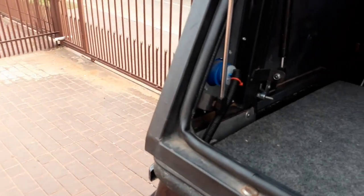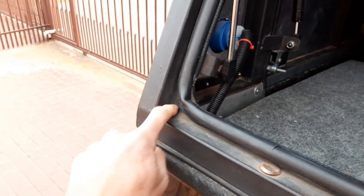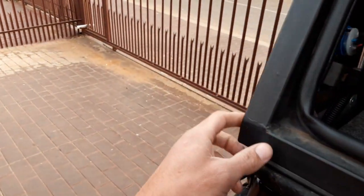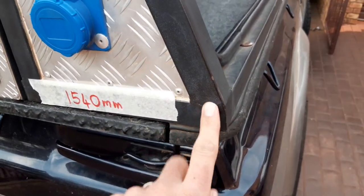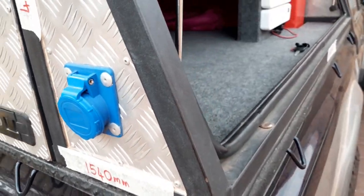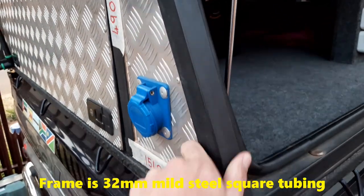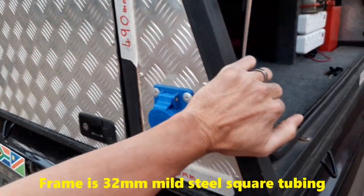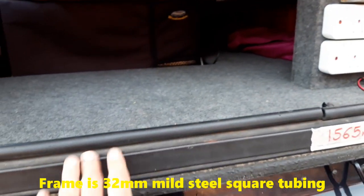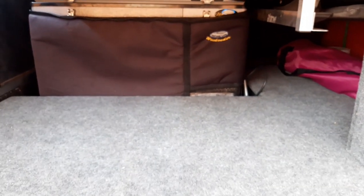Tacked them into place, and then that allowed me to figure out the corner angles — what the angles should be. It was a bit of trial and error. All the main frame tubing is 32 millimeters. I used 3 millimeter wall thickness for the uprights because they're load-carrying, and 2 millimeter for the bottom and top frame, basically just to save a little bit of weight.